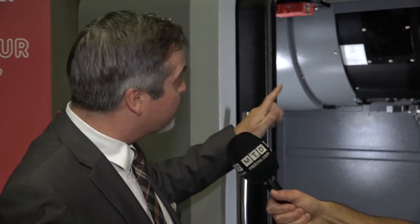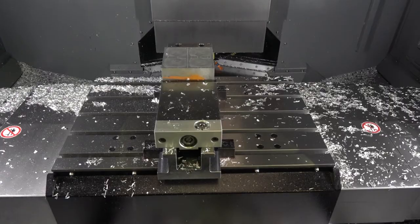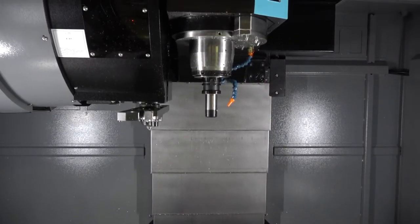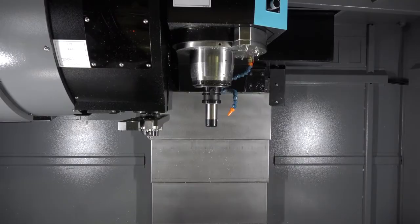What's evolved — and what we've seen the requirement for — with regard to transfer machines, robotic systems, and FMS, is that we needed something a little bit more high tech where we could take the reading from the machine safely, even when it's guarded. You can put the tool into the tool change carousel, call it up as tool 22 or 21, and it will, by means of a radio signal, send it to a handheld monitor — which you have there, Mark — so we can do it remotely.